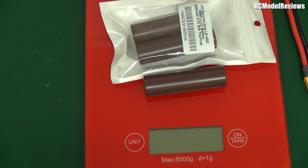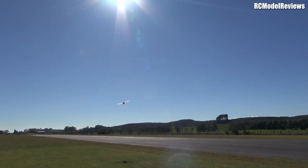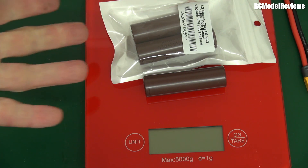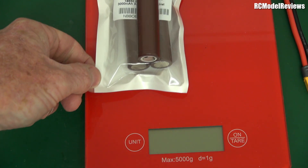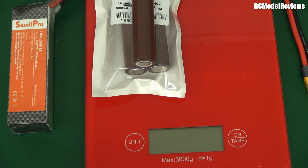I'm going to do a practical comparison using the Rebel GT. I'll make a four-cell, roughly 6000 milliamp pack using these lithium ion batteries, and a comparable four-cell LiPo pack. We'll go fly them, compare the results, see which gives the maximum flight duration and which weighs the most. I thought I'd go through this briefly first at an academic level — the difference in weight and suitability for different models — before moving on to practical testing.